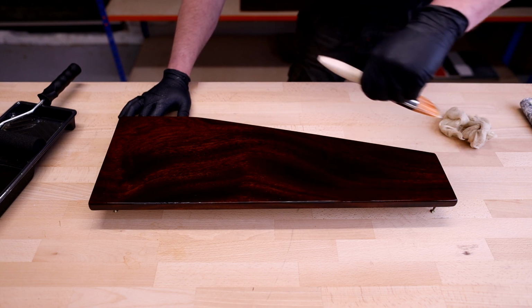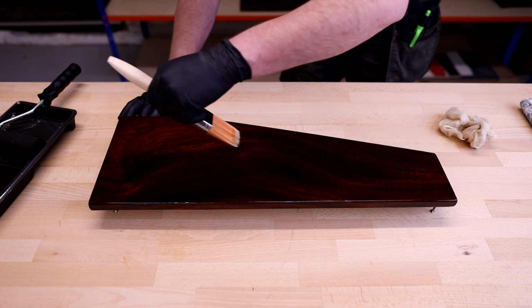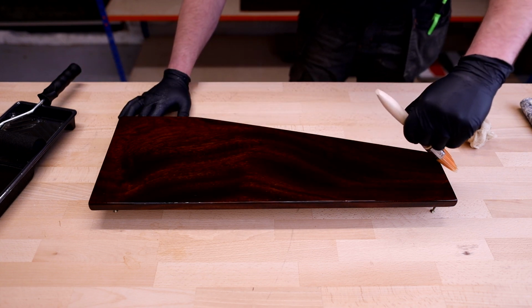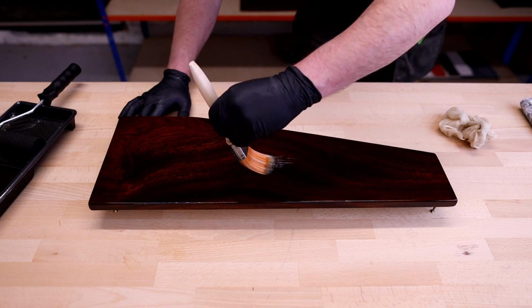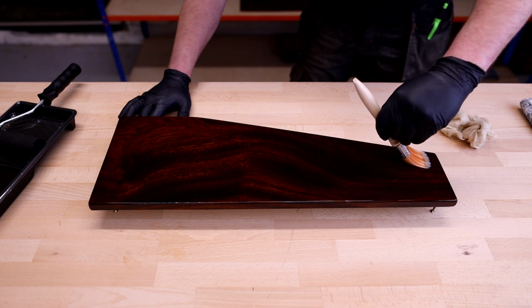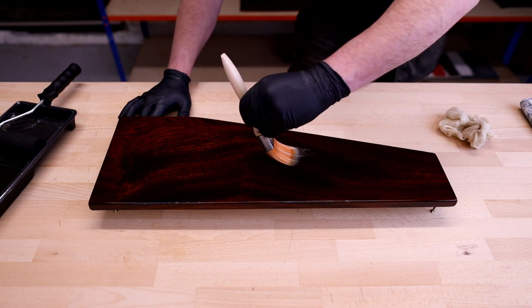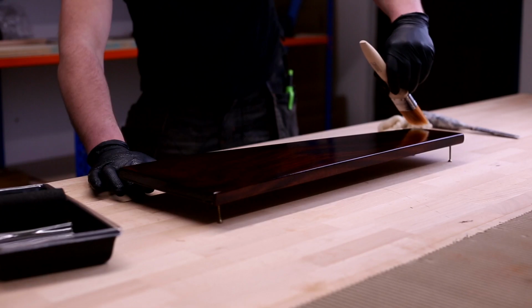And you'll feel with the brush that it gets heavier as you get to the varnish that's already been on there a little while. That's starting to set up, so you'll feel the resistance increase, because there are times when it's quite difficult to tell where that first layer was. So as you feel that increase, just go a little bit further and then lift and feather out.